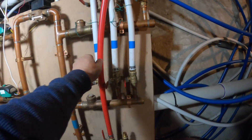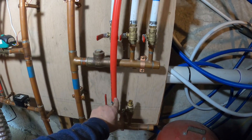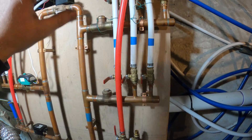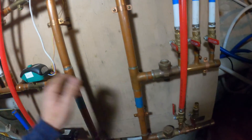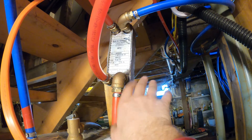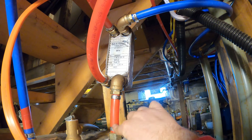It wasn't getting hot over there, so what I did was close all my return valves on my actual heating zones and only have the valve open on my heat exchanger zone. What that does is push all the water through this one loop, pushing that air back to the boiler - which is an open boiler - and then it just escapes into the garage. It's starting to get hot already. Here's the finished install: I ended up moving this closer to the hot water tank because I had a leak in this elbow and had to take it apart anyway.